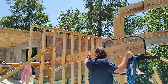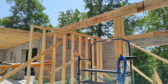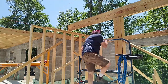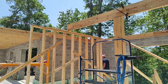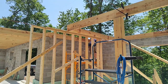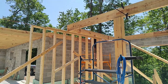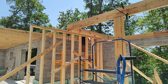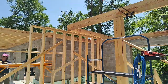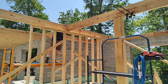I'm not going to go through all of the carrying beam build because I did that in a previous video, but it's very much the same. It just felt a little bit more complicated over here because I was having to build the wall and have the beam come to a certain point, and I'm now having a matching joist that will run straight across the room and define the area of the stair pocket - you can think of it like a rim joist on the other side of the house, it behaves similarly. It wasn't bad, it just took a little bit more time to figure out where I wanted to get started and how I wanted it all to come together, but once it got up everything was really solid.